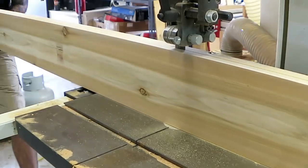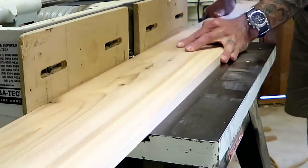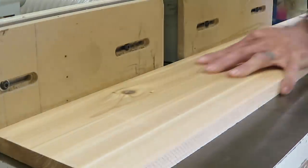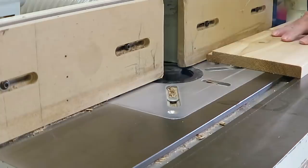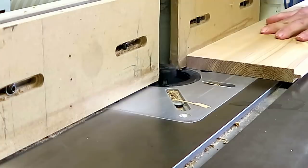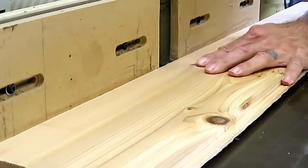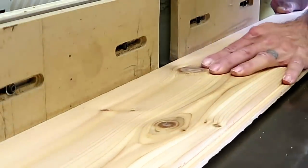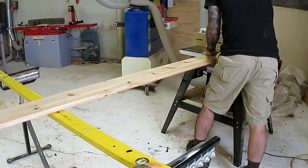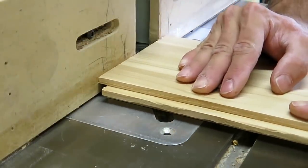But with the main frame made, I needed to make the tongue and groove paneling to go inside of that, so I do all that on the router table. The boards that touch the outside frame of the door, I'm offsetting the tongue so the groove isn't so close to the edge of the main frame of the door. And then I can set up my special jig to make tongues on the ends of those boards.